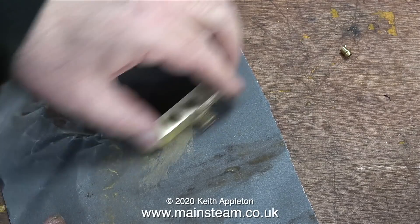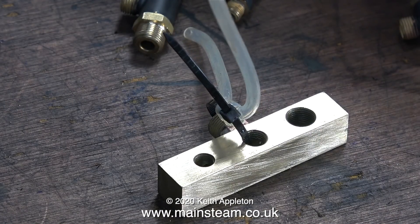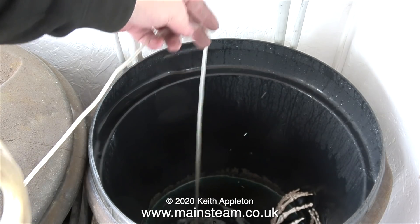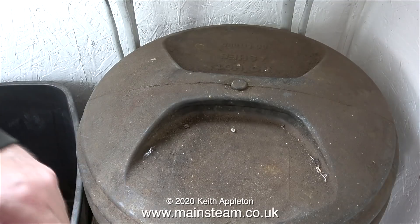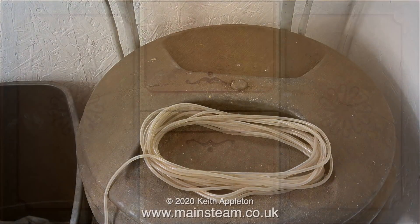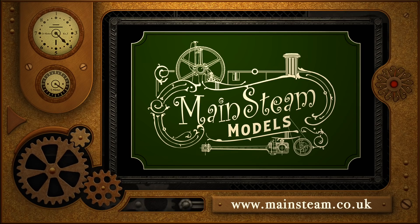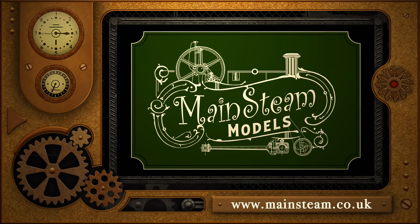I also drilled a hole in the steam union I've just silver soldered to the bar, but unfortunately I forgot to press record so I can't show you that. Here's the story so far: I have a pipe that goes from the tap on the boiler to the three-way steam turret. Using a small cable tie and the usual silicone rubber tubing, I'm placing the component in the acid bath where I'll leave it for 24 hours — it's a very weak acid. This part needs a base to support it; I'll make that in the next video, then test run the boiler with the new three-way steam turret. Thanks for watching and I hope you found it useful. Please visit my main steam models website and click on Video Playlists to find other videos you may like to watch.